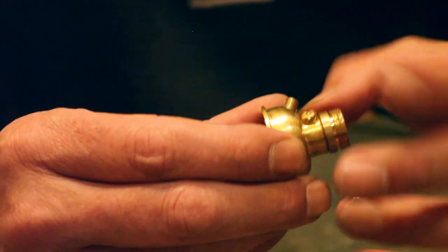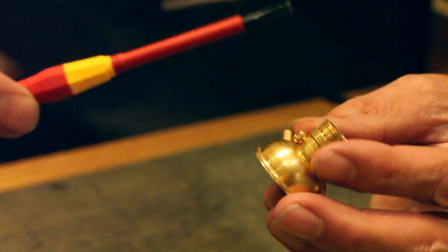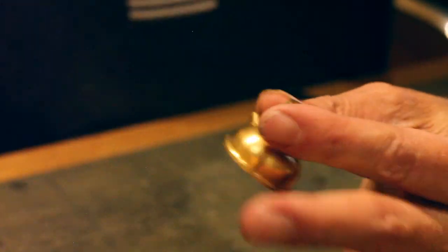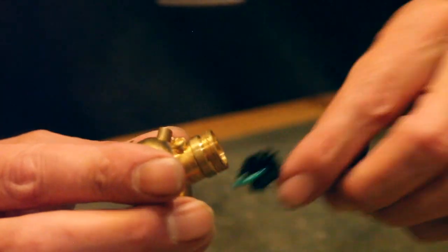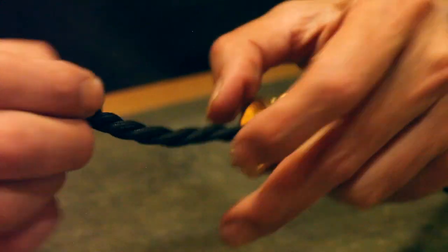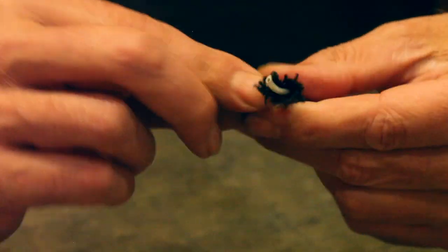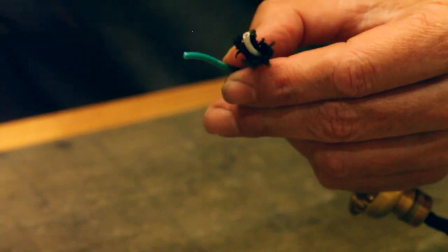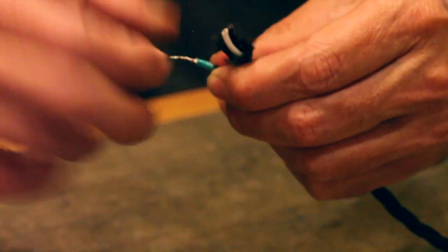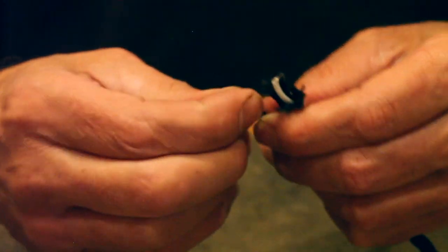our cord grip base to the threaded 10mm threaded entry type socket. And this gets bonded on with a little grub screw, so that can't come off. Now, we can get this component wired by starting with the ground wire. As I say, this is a bit unique to us, but at least if you do need a ground, this will do it. Strip the cable, we'll twist, only needs to be shortish, about half an inch.